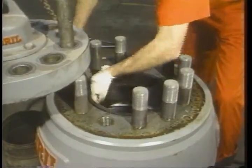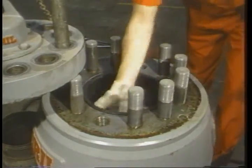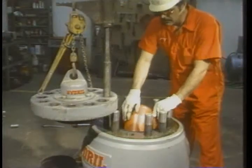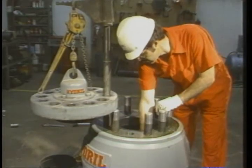After getting it to conform to the shape of the body, seat the neck loosely in the shoulder. You may need some help pushing the walls out to meet the body, since a new diaphragm is pretty stiff. If yours is a Hydril dampener, now's the time to install the new stabilizer. Just reverse the removal process.